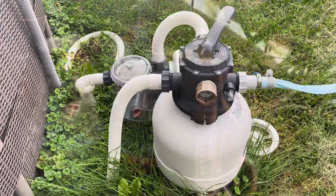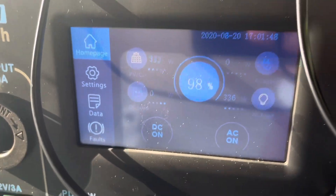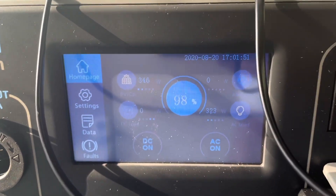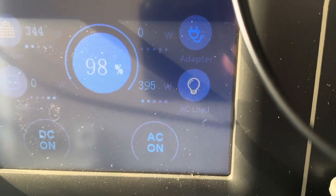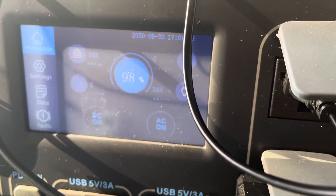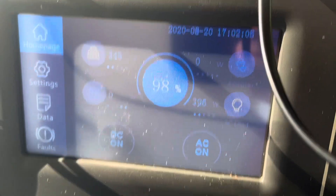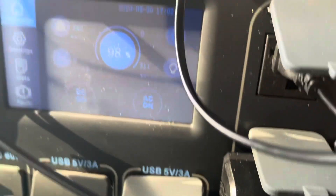Last little update — it's about 5:07 PM. We're in the Chicagoland region, that sun is like directly west. The pump is taking 324 to 344 watts, so it's gonna start dissipating a little bit. There's only a couple hours left on the pump so that should be fine. The DC load is almost negligible — I just got a little camera hooked up and these batteries powering some little lights and small batteries, so those are almost done.